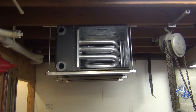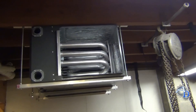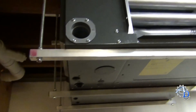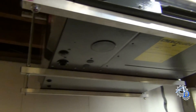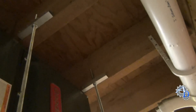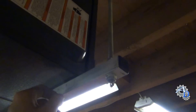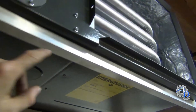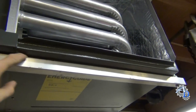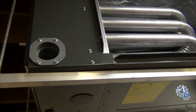So I finally got the furnace mounted on the ceiling. I can't really say it was the most fun I've ever had in my life, but it wasn't too bad. I'll give you a brief look at how I did it. You can see I used 1-inch aluminum tubing, thin wall — it's only 1/16 inch but it's plenty strong enough. There are the aluminum brackets I made, and 3/8-16 threaded rod as called for in the instruction manual. I also put foam rubber with an adhesive back — that's to dampen some of the vibration so it doesn't get transmitted up into the floor joists.